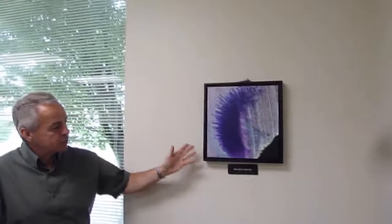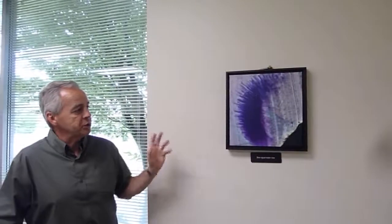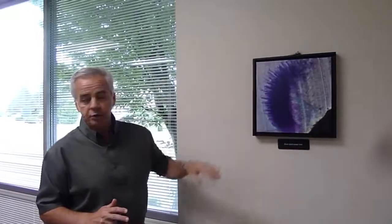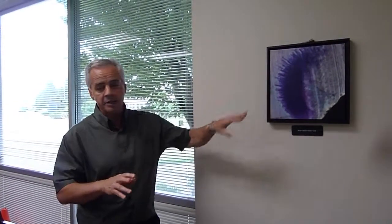And then here's another water tree, another shape. So they come in all sorts of shapes and sizes. Some people want to call them bush trees and stuff like that. But the last thing I want to say about water trees is, when I was explaining the electrical tree, I was clear that there was a channel, but I wasn't too clear what a water tree is. It's a chemical oxidative degradation of the polymer. So there are no channels. No matter how close I look at that with a microscope, I'll never see any physical things until I get down to the molecular level, where it's oxidized polymer that is there.